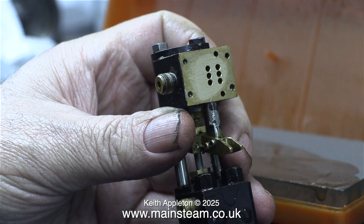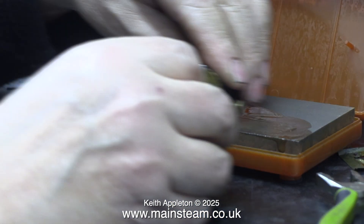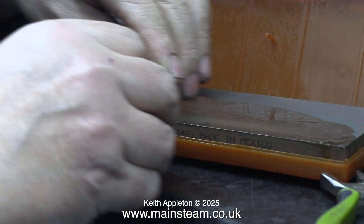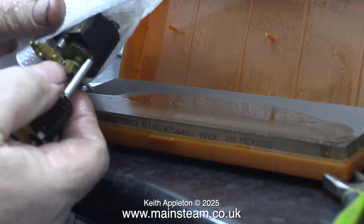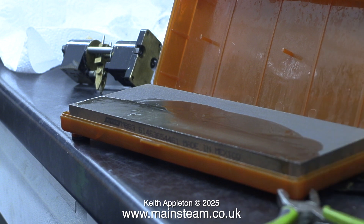This really did take quite a while. In this clip you can clearly see that the port face is not flat — I've rubbed it up and down the wet stone and there's a nice shiny bit in the middle, but I need to continue until it's all like this. This took a lot longer than you see here; in real time this job took over 20 minutes to complete. And finally, at last, it's flat. I wiped away all the residue and that's one job done.